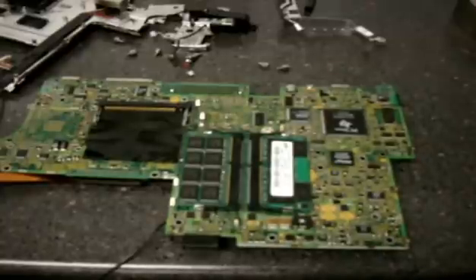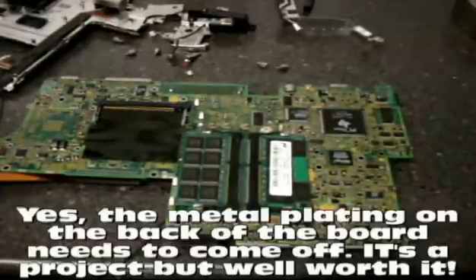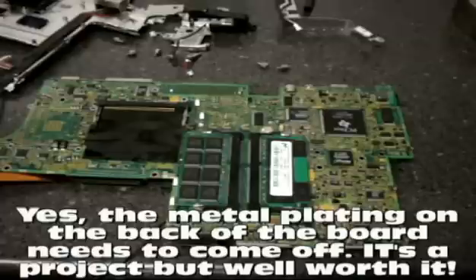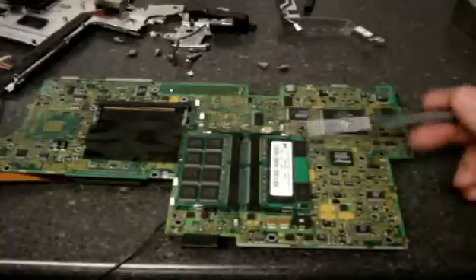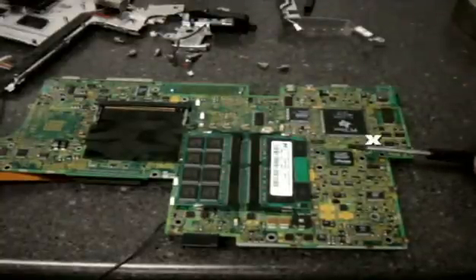It's actually written on an Atmel chip that's on the wafer board. The whole unit needs to be taken apart. You're looking at the motherboard — this is the back side of the motherboard, and the Atmel chip is actually located here, near the two memory modules, on this side.